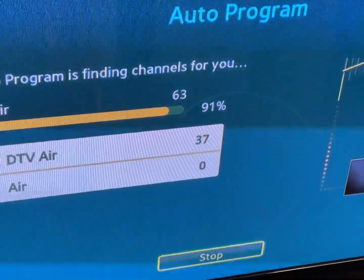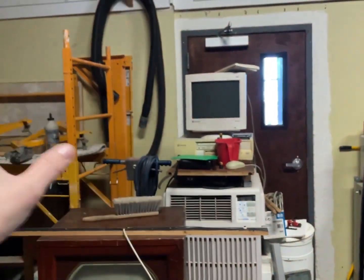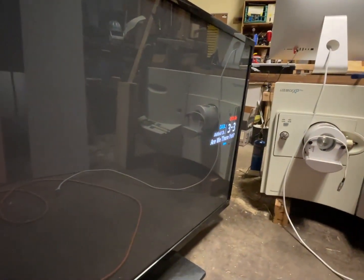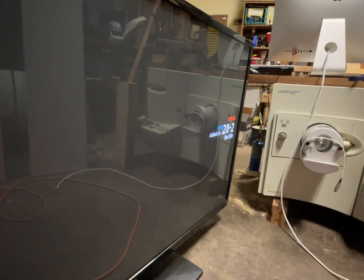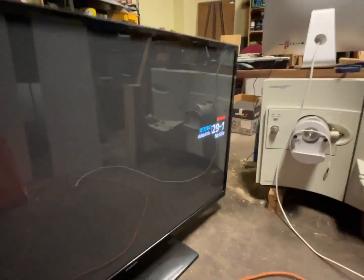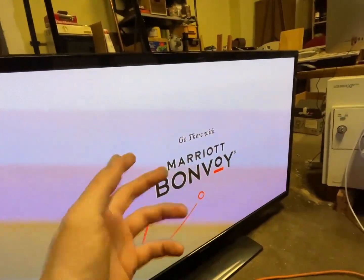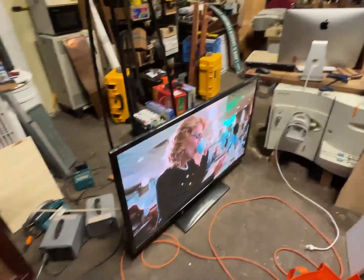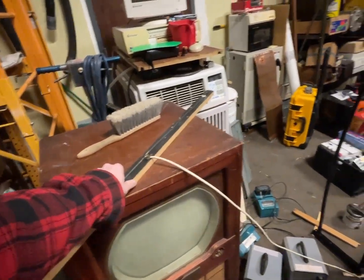37 is pretty good for such a compact antenna. That same cable was connected to a 6-foot long antenna before and that did a whole bunch. We got channel 29, though not very strongly. The antenna must be oriented toward the transmitter — if I turn it one way it gets jerky, but if I turn it this way signal strength improves a lot.